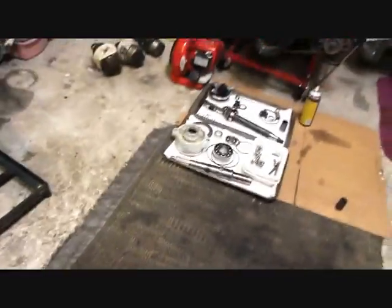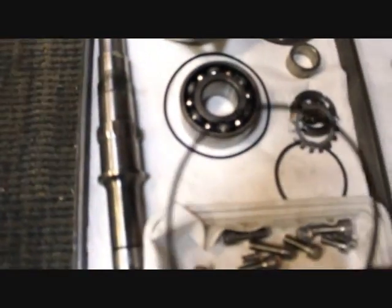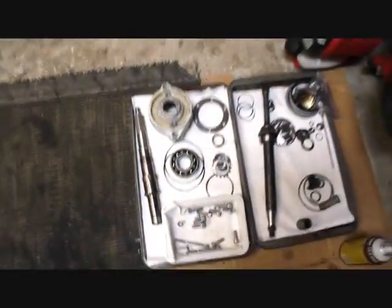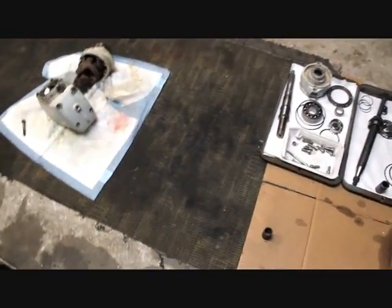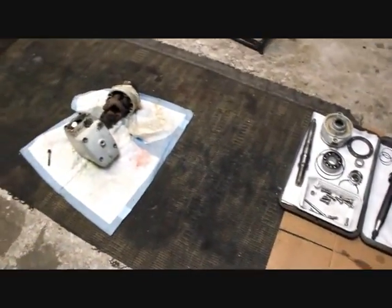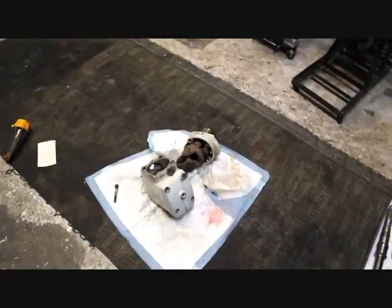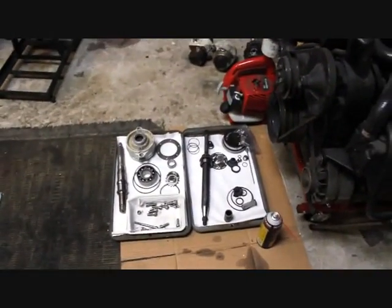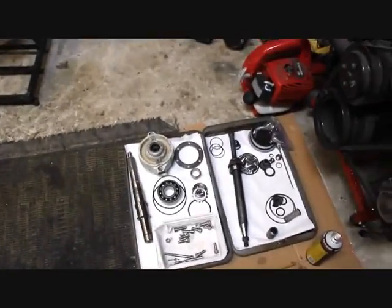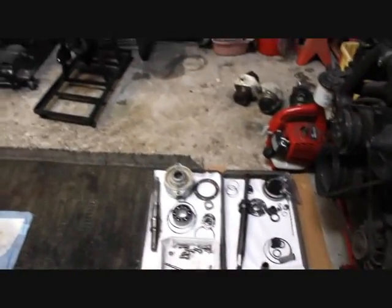As a side note, I was online and I noticed that a lot of farmers tend to take rubber seals and stuff like this, especially ones that can't be replaced or are really hard to find. What they'll do is soak them in transmission stop leak — you know, the fluid you dump into your transmission to stop it from leaking. It'll plump all the rubber back up. As long as they're not dry rotting and deteriorated — and actually even if they're a little cracky — it tends to fix all that because it makes it all swell up. So soak your stuff in the fluid overnight, and next day I tell you what, it really does work. We've used it in the past. But it's time for us to go to work.